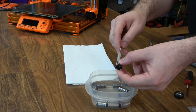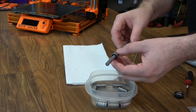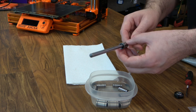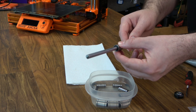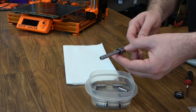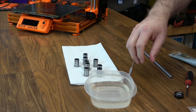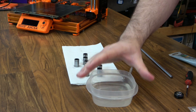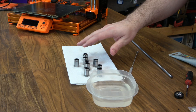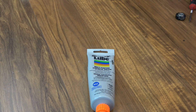After they've been soaking, we definitely need to get them dried off — we don't want any alcohol to get mixed in with the grease we're going to pack them with, as that will degrade it. Make sure they're nice and dry before you reuse them. If you want to clean them a bit after soaking, that might be even better — you can use the brush. I also like to use a spare rod and just cycle them a few times, rotate them, and make sure everything's free. A lot of times with a bad bearing you'll have a lot of play side to side — make sure that's not happening. Pick all the ones you like best and get everything dried out. Also, this is a great time to check your container for missing balls. If there are any, find which bearings they came from and rule those out.